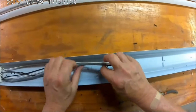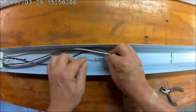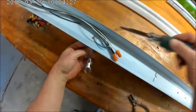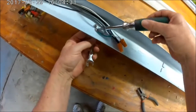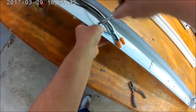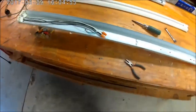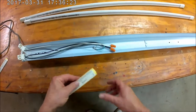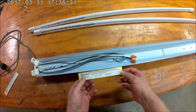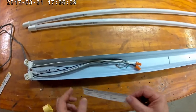Now put your ground wire in — ground your fixture. You can put a bolt on here. I went ahead and attached my ground wire with a small bolt. Now I'm going to apply one of the warning stickers — not to put any more fluorescent bulbs in here — indicating this has been changed to an LED fixture, placed right near where the supply wiring is.